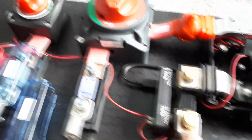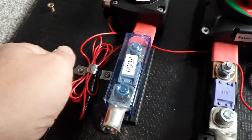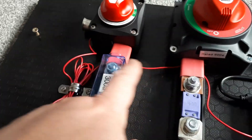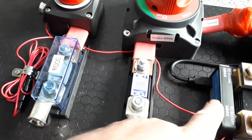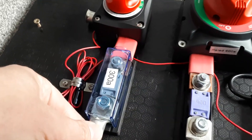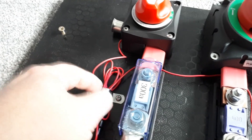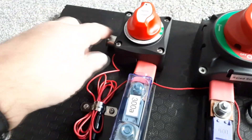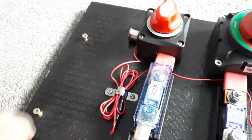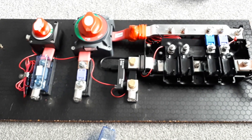On this side it's much much simpler. It's got one lead coming over from the shunt that just monitors the battery capacity — it doesn't do amperage or anything like that, just voltage — so that connects in there. And this is the lead coming out that goes down to the engine. So that's much simpler. It's quite a neat setup.